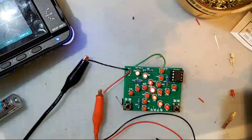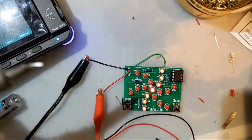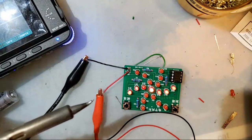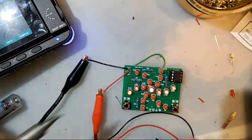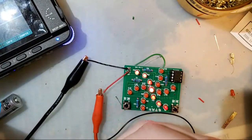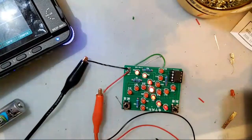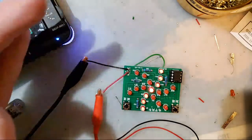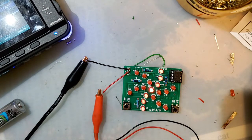If you solder, what you're doing is transferring heat into the component. When you touch the soldering iron to the component, you're transferring heat into it. You do not want to do that because batteries are very sensitive to heat. It will lose capacity depending on how hot you get it. And if you get it too hot, it will literally, I'm not making this up, explode. Do not solder tabs to batteries. The reason they spot weld is because, yes, it does get hot, but it's so focused and for such a short amount of time that it does not negatively affect the battery chemistry.